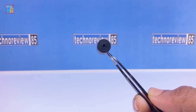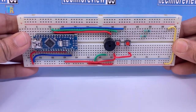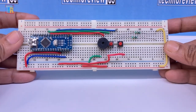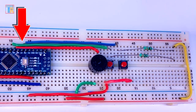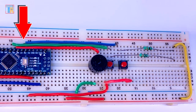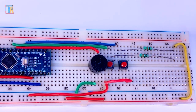To make this first project I am using an Arduino Nano, a 5-volt buzzer, two micro switches, two 10k resistors, a breadboard, and some jumper wires. Two 10k resistors are connected between Arduino 5-volt positive and Arduino D7 and D4 as pull-up resistors. Two buttons are connected to Arduino pins D7 and D4 and GND. A small 5-volt buzzer is connected to Arduino pin D6.